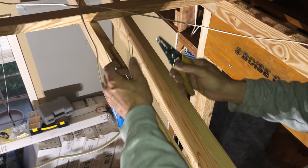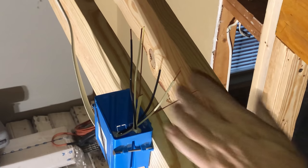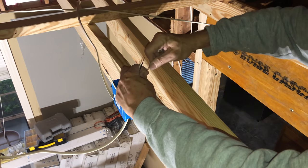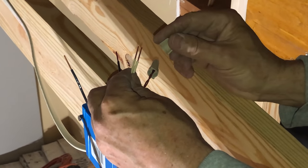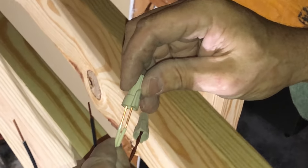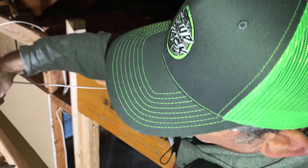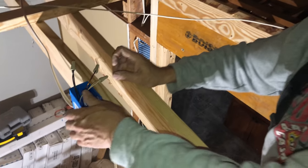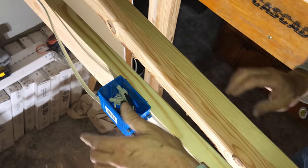We've got our box nailed off. I'm going to strip all these — one, two, four — grab three wire nuts out of my pouch and hook them together. Remember, ground's always first — even though we know this is off, it's a great habit to have. When reconnecting something, connect the ground first, then the neutrals, and always make sure the ends are even. When putting two number 14s together, I don't pre-twist — the wire nut does that. With three number 14s, I'll pre-twist, and I always pre-twist number 12. That just means grabbing my linemen and twisting the wire ahead of time. That one's done. I'll staple everything off at once with one trip in the attic. Tuck these in, put the cover plate on, and we can turn that circuit back on.